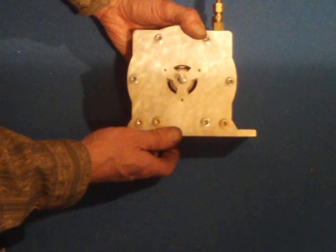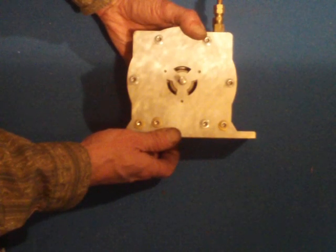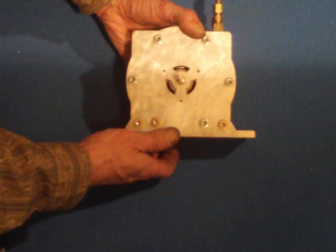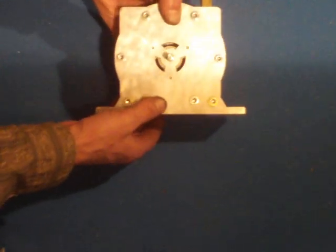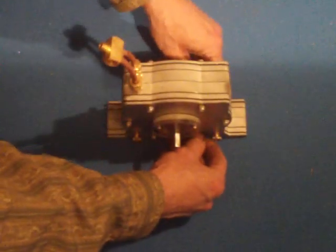With the rotor, be mindful after reassembly that there are no specs of any material inside at one millimeter or less. If debris contacts the rotor edge or stator, you will get a stall and it won't work even under high steam pressures. It's essential that the rotor is not conducting any friction other than on its washers, which ride against the inner bearing race on each side with the bearing plates.